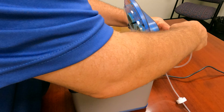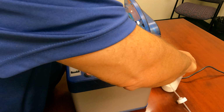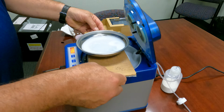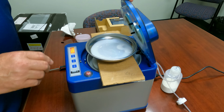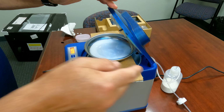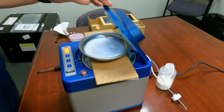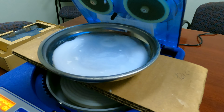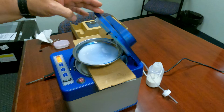You'll want to prime the compound. So go ahead, take your tubing, put it in your compound. Make sure you shake that compound up or get a fresh bottle from us. But you will want to make sure that it's not dried up and clumpy and cause clogs. So again, you're going to go ahead, press stop function, and you'll see the compound just started to come up through the tube. Okay. And it's coming through nicely.